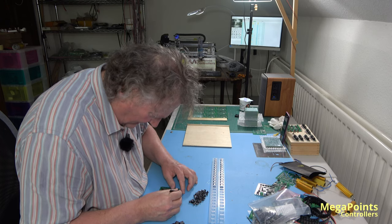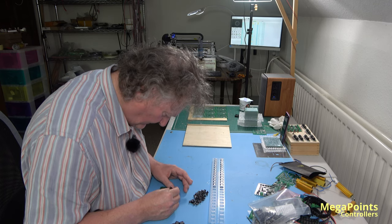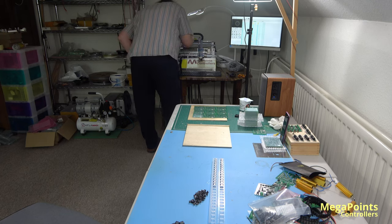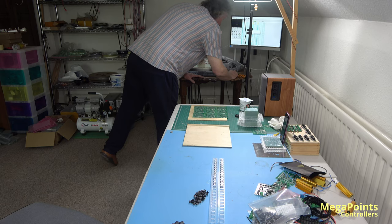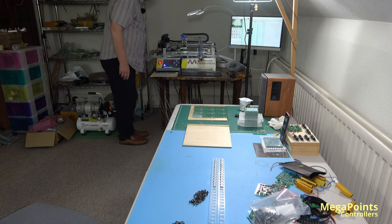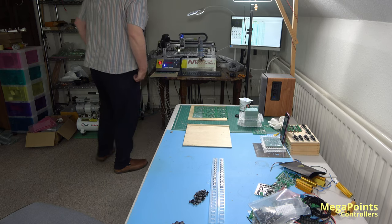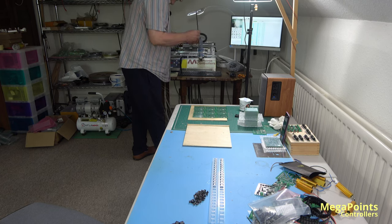That was an LED there trying to escape. Is that right? Is that on the vault? On the... Oh, nope. What's happening here? It's an LED problem. It's misaligned again. Feeders, bane of my life. It's not about the head for placement, it's about the feeder. Your feeders are good, everyone's happy. Keep having to duck and dive the head, cleaning things, moving things, adjusting things, keep the machine running.